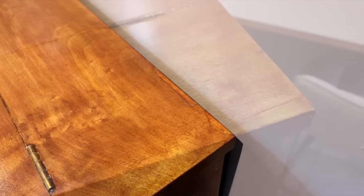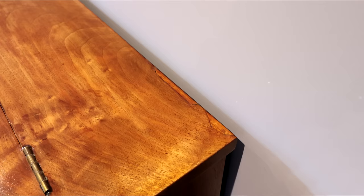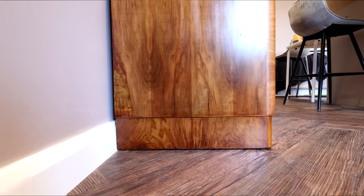This is only my second time doing this kind of veneer repair so I'm still learning, and I learned a lot on this project which means the next one I do will hopefully be a lot better. I think I just should have spent more time making sure they were a perfect fit before gluing, but I didn't expect the gaps to stand out as much as they did. I think that's because of the stain I used soaking into the edge grain of the veneer patch which made the gaps quite dark in colour making them stand out.